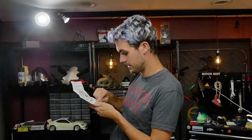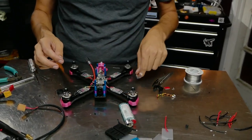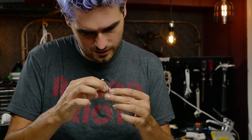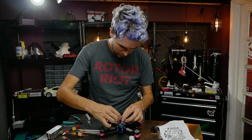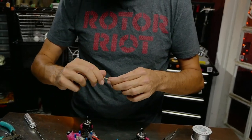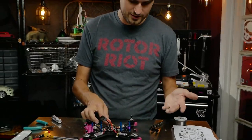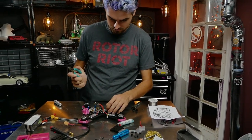On the back they've got all pads labeled so you know exactly what goes where: the two-plug harness has blue to menu and black to ground; the loose wires are red for 5V, black for ground, green for TX, and orange for RX. We need to figure out which UART this talks to. UART 1 is for our receiver, and UART 3 is where we'll hook up the camera control adapter. I'll stick it down up front, route all four wires under the flight board, and use the double-sided tape that came with the camera.